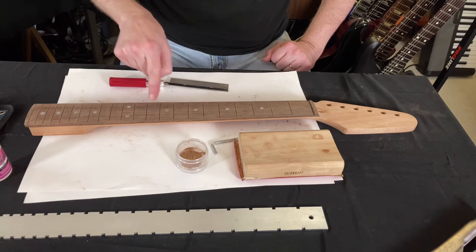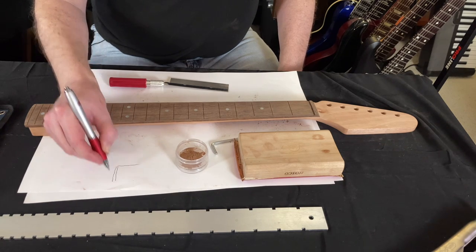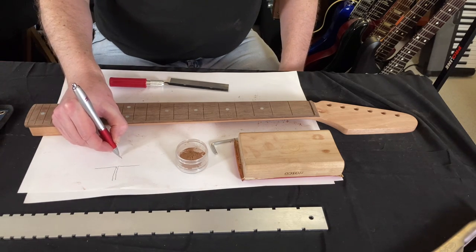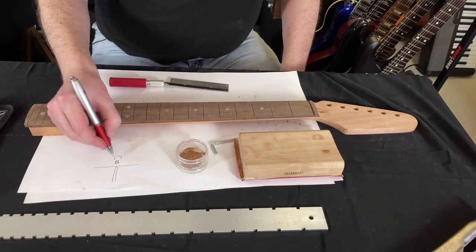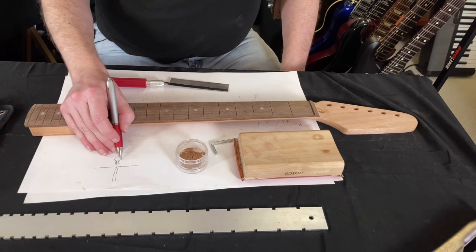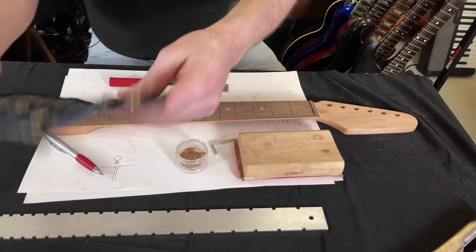So the next thing I want to do — let me show you. I'm drawing upside down, but here's the neck, here's the fret slot. The concept is your fret is shaped like this, with little notches — little barbs designed to stick in the wood. But the issue is it doesn't go flat; it goes kind of like this. So this wood here needs to match that same shape. What I'm going to do is take off a little on the sides.